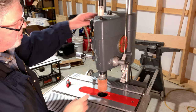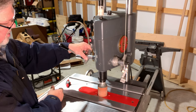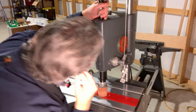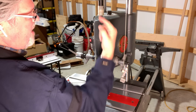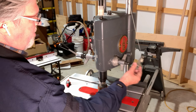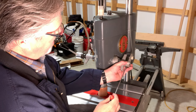Here's where we really have to start paying attention. We want to extend the quill about an inch and a half, get ourselves down inside the insert, and lock that quill extended. It's important that when we turn this on, we don't leave the quill locked in this position — we're going to have to unlock it. Up here, I want to make sure that this rotating shaft is aligned to 11 o'clock. Then down here, we're going to connect this little linkage right here onto that shaft. This is what's going to be moving the quill up and down, and depending upon where we position this in that slot, it will determine how much stroke we get from the sander. We'll just slide that on and lock it in place.